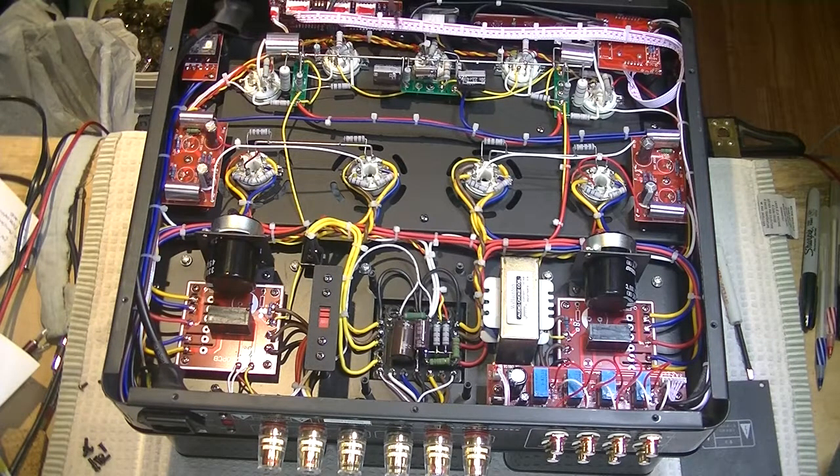I mean, these electrolytics here, actually I didn't even talk about that. This center tube is in the B plus, in the DC power supply side of things, and that tube, the 6SN7 in the middle, is actually not handling any audio. It is in a filter capacity. And these electrolytics here, these are Nichicon. Those are good quality brand name electrolytics. That's nice to see. Now these are polypropylene caps right here. They're rebranded Willsenton. But you know, there's no reason to think that they aren't decent quality as well. They certainly don't appear to be junk.